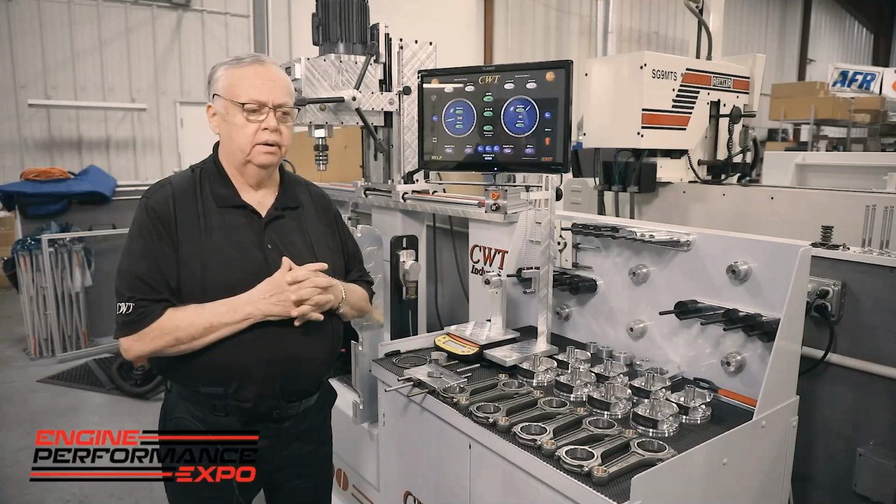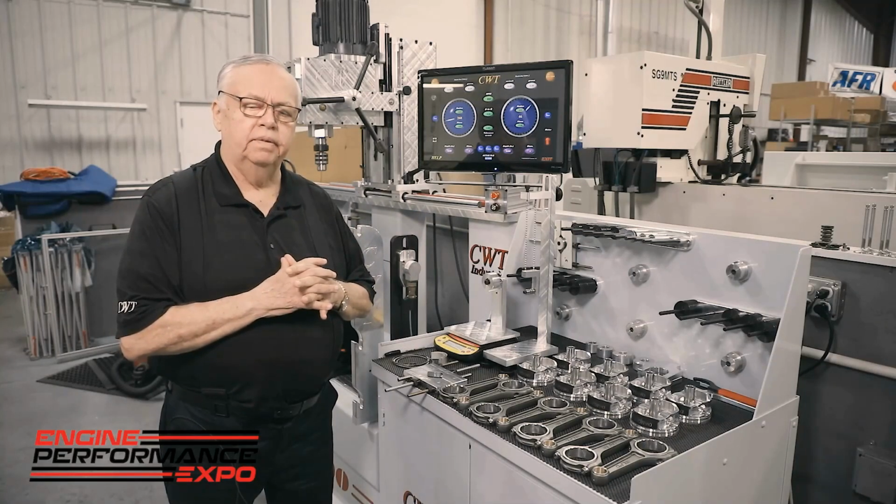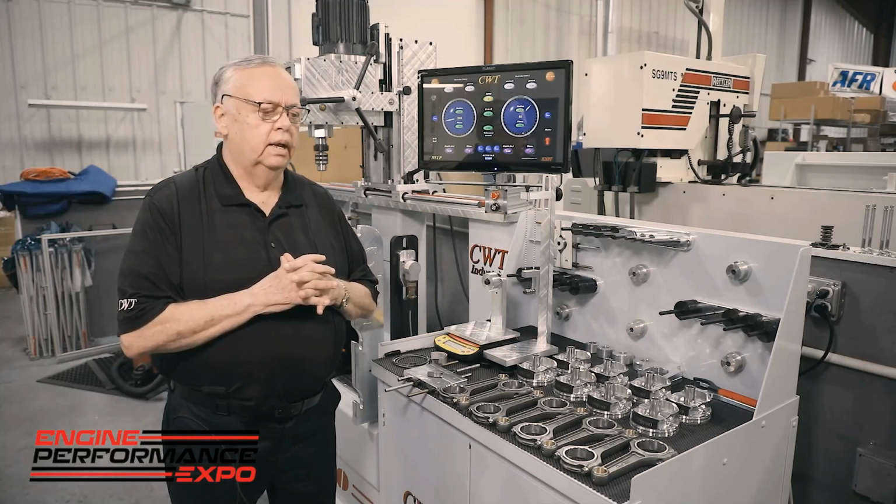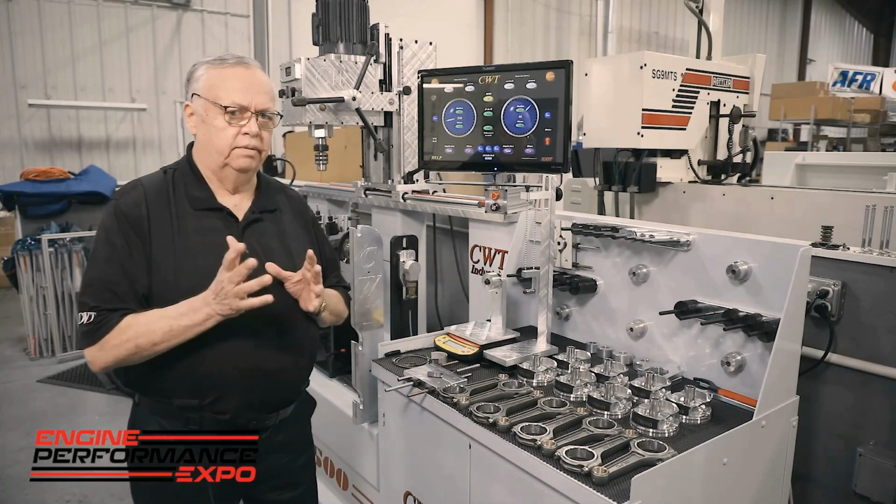All right, in the art of balancing, the first thing we have to do is understand tolerances of balance. A lot of people are just picking numbers randomly throughout the air. Well, they should have never done that. In fact, what you want to do is use the ISO. The ISO is basically an international standard. In fact, it's under the heading of 21940. Now, what that really means is, and I'll give you an example here,